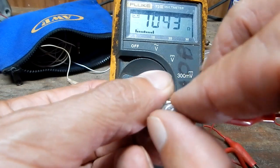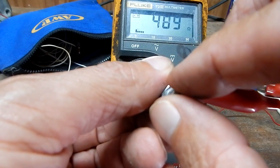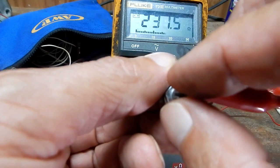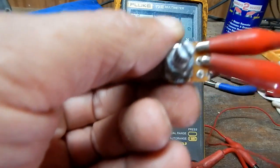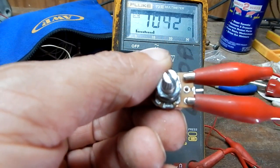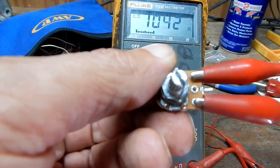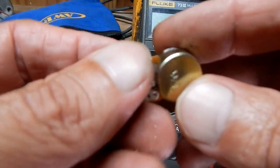Take the end wire and put it on the other end — see, the other end reads the opposite. Then you just turn and dial it down and look for a nice smooth transition, and you know you have a good rheostat. Plug it in from end to end and you just read through the resistor — that's all there is to it. Thanks for watching.